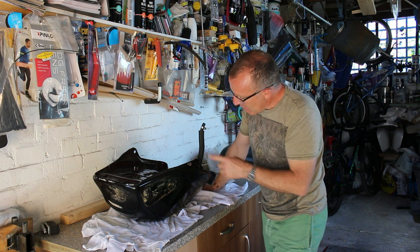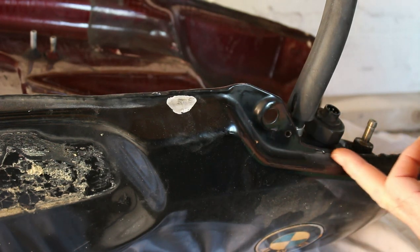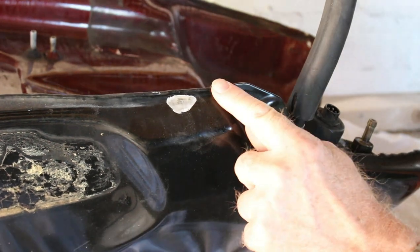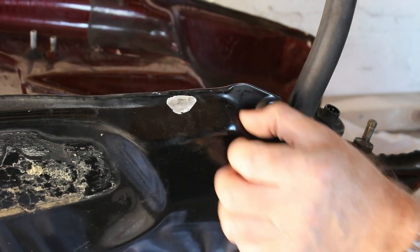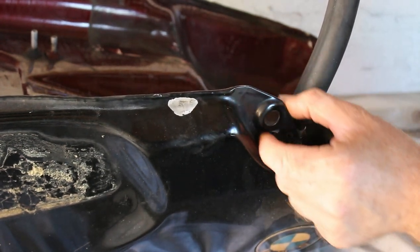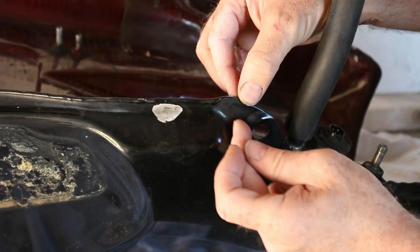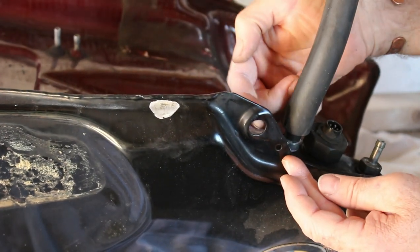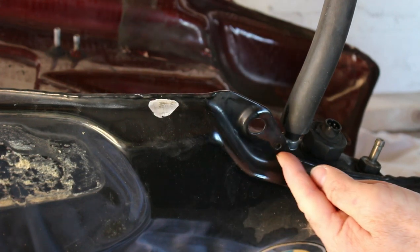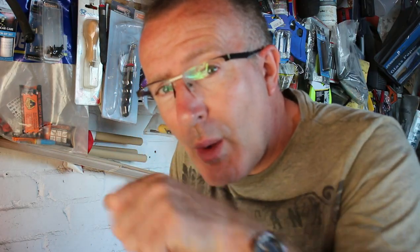I also need to remove these sections here. It might look like you have a seam welded up and that cutting it would break into the skin between the two welds, ending up with a hole or a slot — but that isn't the case. This bit here is actually almost an extra piece of metal that can be cut away very gently from the inside. I'll need to remove the fuel hose, and using a small Dremel I can cut gently to the welded seam to give a nice line, then file any sharp edges off.